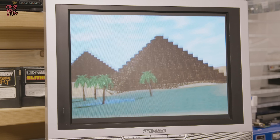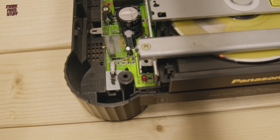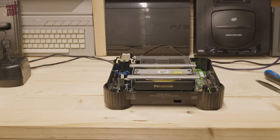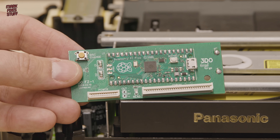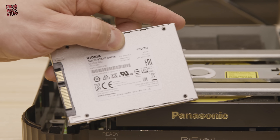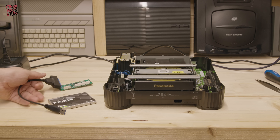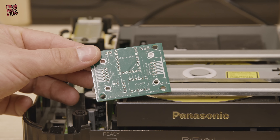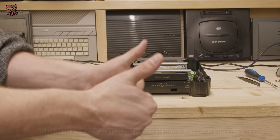I'm always mindful that one day I might have to replace all the capacitors in a 3DO FZ1, but it's not happened yet — it's always just been the ones in the power stage. My plans for this pile of bits: I want to use the parts in this box to make an entire console. I'm going to install a 3DO FZ1 ODE designed by Fixlesan, hook it up to a 480GB SSD, and I'm really hoping a £2.66 AliExpress SATA-to-USB 3 cable will do the trick. Because I only have one Monkey controller, I'm going to make an adapter to use a PS3 controller and a mouse via USB. I'll also adapt the internal transformer to work on UK voltage — no more step down.